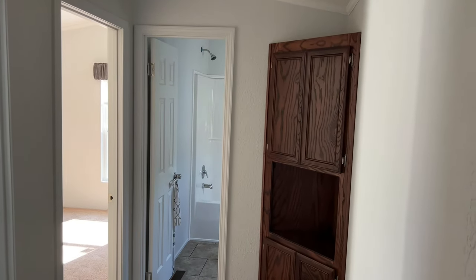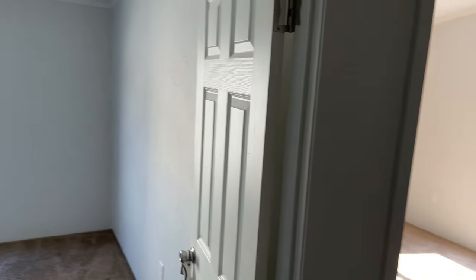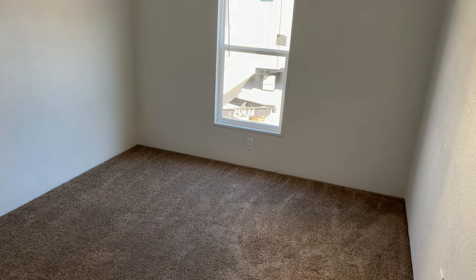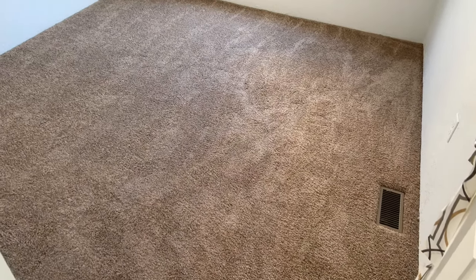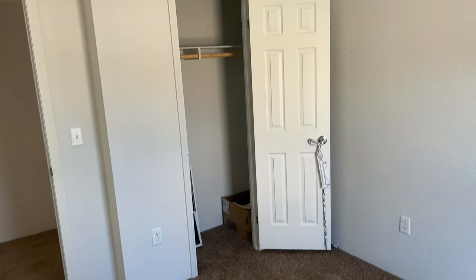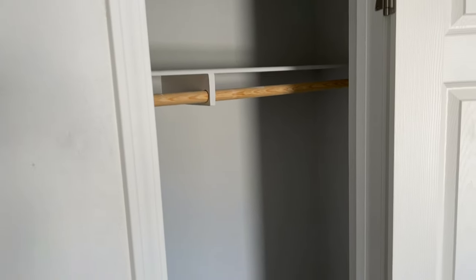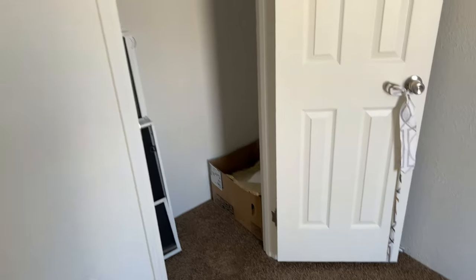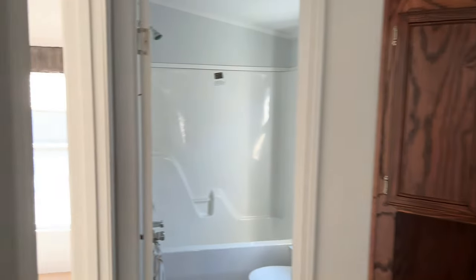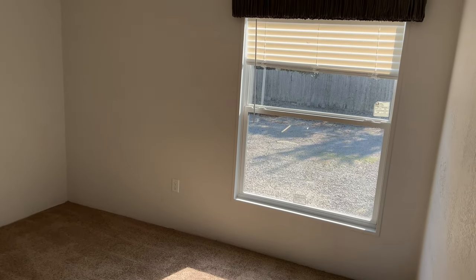In your guest area, you can see we have linen storage to the right of the bathroom. Going into the guest bedroom: the third difference on the 18-wide is your floor joists. Typically you're going to have a 2x6 floor joist on a 16-wide Solitaire home — once you go to the 18-wide, you're going to a 2x8. So the main upgrade difference is all framing and interior structure, stuff you're not necessarily going to see. There are also sizable guest closets. This floor plan has the largest bedrooms out of any of the Solitaire three-bedroom homes.